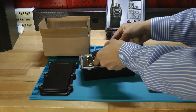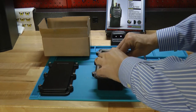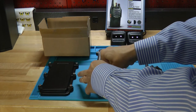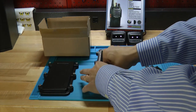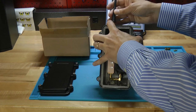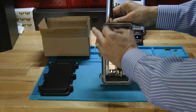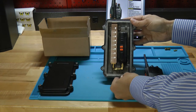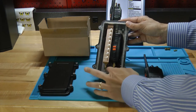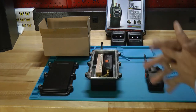The reason we do that is it lets us fold the radio over and set it down in the channel. Now go back and tighten up all the internal connections finger tight — no tools needed. There should be four connections in there; make sure they're all nice and snug. The last thing is to take the antenna we removed and attach it to the top of the box at the barrel on top. That is the receive side — the attenuator installed, barrel attached at top, connector assembly built up, radio folded down and attached, everything finger tightened, and antenna attached to the outside.